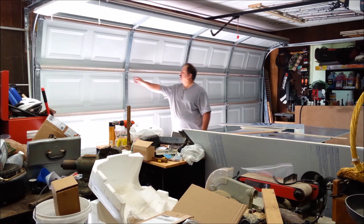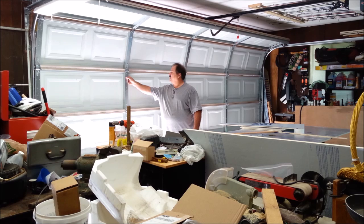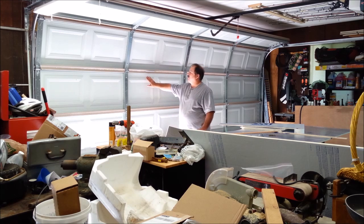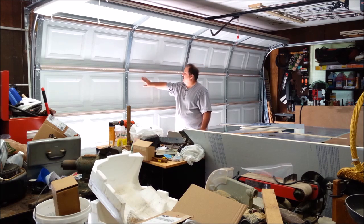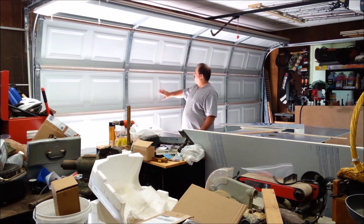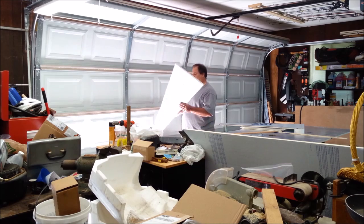I've got a few problems like the screws going through here, but I can run those out and run them back in, and they'll thread back into the foam. I bought a roll of batted insulation, and I plan on stripping that into thin layers and filling up this with fiberglass and have it kind of pressing and holding the panel out against these lips. But the panel has to be a couple of pieces in order to fit it in there, so I'm experimenting with what the best shape is.